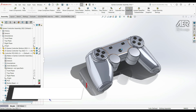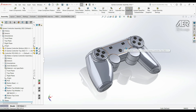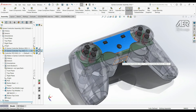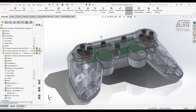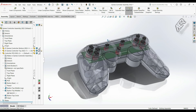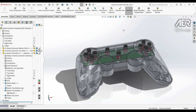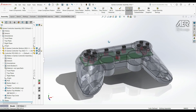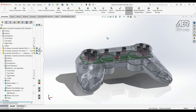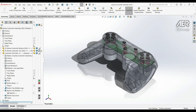To recap: from within the assembly we inserted a new part via Assembly > Insert Components > New Part, placed it on the PCB cut area, used a center rectangle, and extruded a board shape. We drew pentagons, rectangles, and circles as the bottoms of the buttons, extruded those, then drew circles, pentagons, rectangles, and a triangle for the tops, extruded in three different features for three sets of different heights, rounded off all the tops, and finished the PCB by adding appearances. In the next video we'll cut the holes for the buttons and make and add the joysticks. Thanks for watching — hopefully this can help a little and be useful.